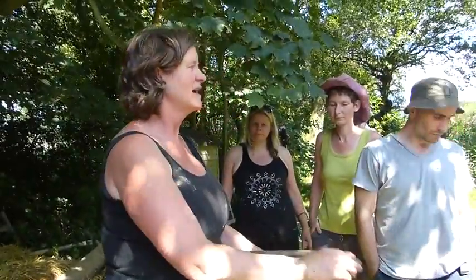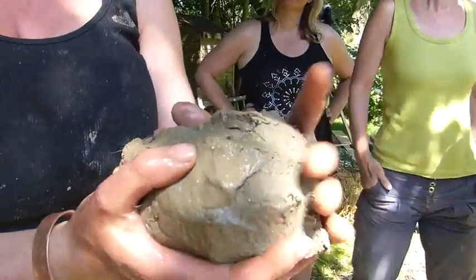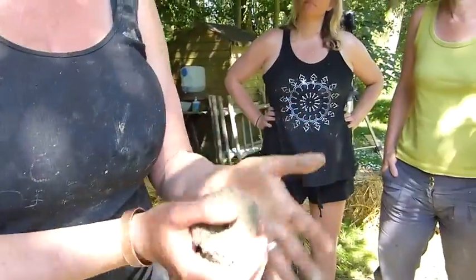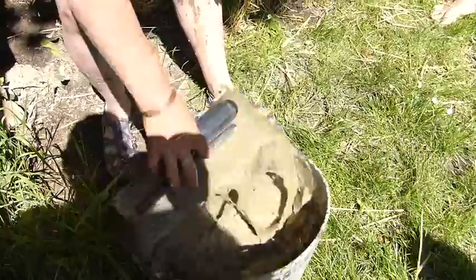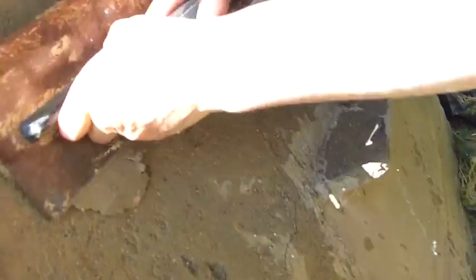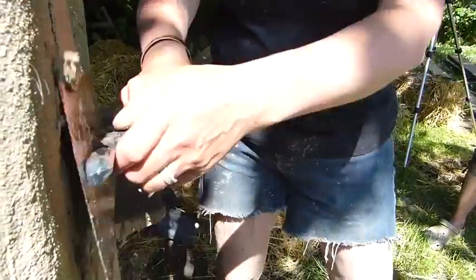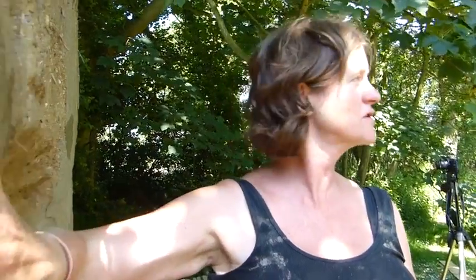The other half is the timing — getting the clay plaster on the wall and finishing it at the right time. Put it on, let it go off a little bit, then finish it when it's just about ready. That's when you get that perfectly smooth, beautiful finish. It's got to be the right consistency. Some people use hawks — I just use a handful. You've got to get your trowel fairly wet. Place it on — it's just like icing a cake, essentially. Using a fair bit of pressure: if you can keep the angle as low as possible, you get more of a sweep. There's quite a lot of force to get it on there; you want to squeeze it into all the holes so it has a good key. If the wall is too flat, you can do a little scoring up.